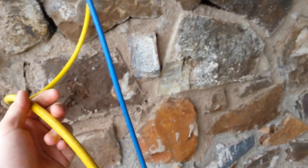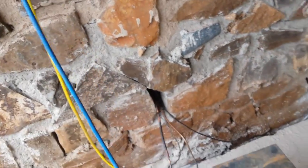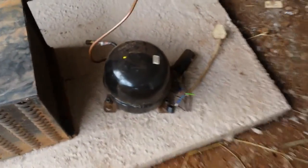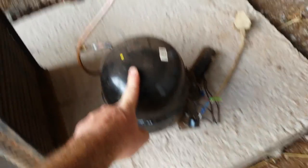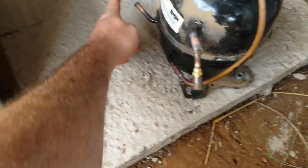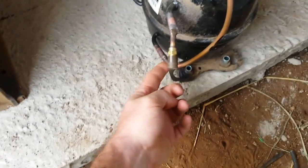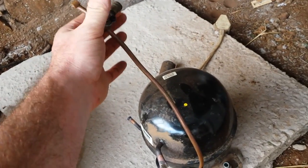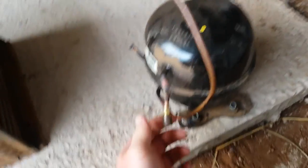Your yellow line is where you put your gas into the system. Over here I have another compressor — just an old 134A that I'm currently using as an evacuation pump. I've sealed off the charge line, and over here you can see is the heating pipe. I brought it up over here and I've also put a valve on it so I can blow and suck on the suction line whenever I want. I just hook my yellow line on and turn it on, and then I evacuate all the air out of the system.